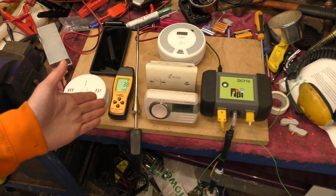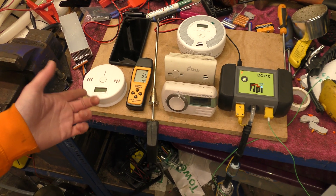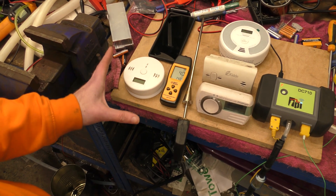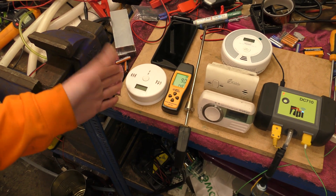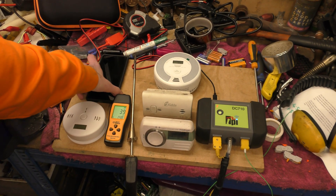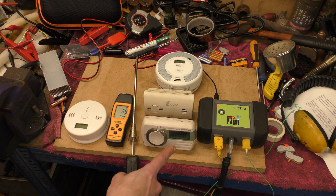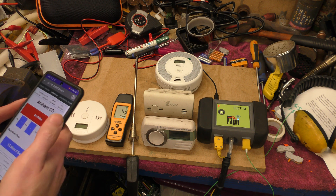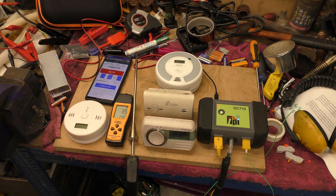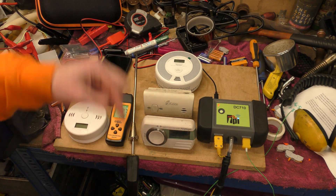The cheap one does make a noise by the way - you can hear it chirping away and it starts chirping at about 20 parts per million, which is good. But at least you can silence this one. It's cheap - it's better than absolutely nothing, but it does run on AAA batteries, so you've probably not got a lot of warning if it decides to flatten the batteries overnight. These others all beep and give you low battery warning alarms. Has the TPI actually come down far enough that I can turn it off? No! It's still way up in the 50s - that one says 61, that one says 30. So that was a quick look at some of the carbon monoxide alarms available on the market today. Any questions or comments, as always, leave them down below. I'll try my best to answer them - thanks for watching!